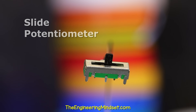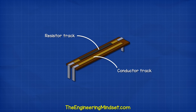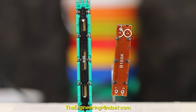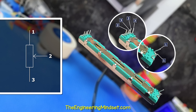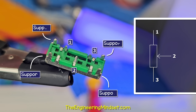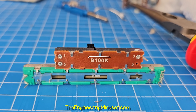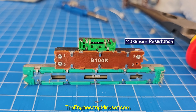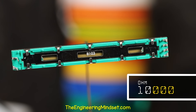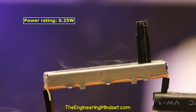Slide potentiometers look something like this. We slide the dial to adjust the resistance. They often have a flexible cover for dust protection. Inside, we have a resistive track and a conductive track. The wiper acts like a bridge between the two tracks — moving the dial moves the bridge and changes the resistance. The three pins are sometimes numbered underneath, but not always. We also have six-pin versions which have two sets of tracks inside — basically just two slide potentiometers joined together. There are usually some other pins just used for mounting the device. The first letter printed on the bottom tells us the type of taper, and the numbers tell us the maximum resistance. For example, 103 means 10 with three zeros after it, which is 10,000 ohms. 100k means 100,000 ohms. They have a low power rating and are typically rated for at least 10,000 adjustments.